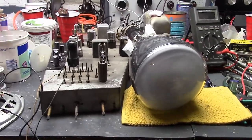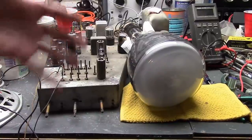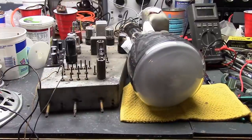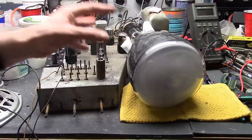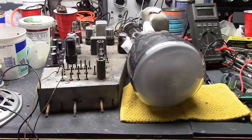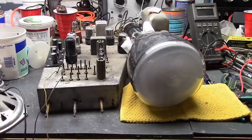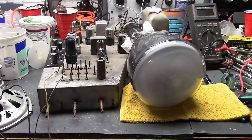And as usual, using a green phosphor CRT. In fact, the owner just shipped me the chassis. I don't even have his picture tube, but even if I did, I don't want to risk damaging the precious P4 black and white type phosphor. And finally, I've rigged up just a cheapo modern 8 ohm speaker for sound. Here we go.